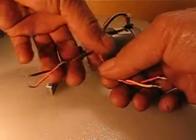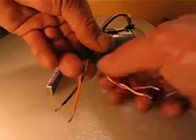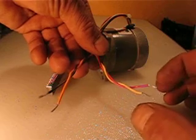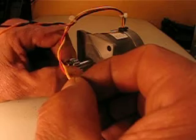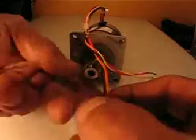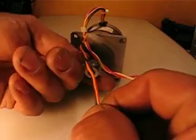I put together each of the wires to identify each phase, and let me show you a trick. When you put the wires together belonging to one phase, you can feel in your hands how the magnetic field is applied. When you release, you feel it go soft. If I put the two wires together and move the motor, you can probably hear the steps, and when you remove them you feel the difference.